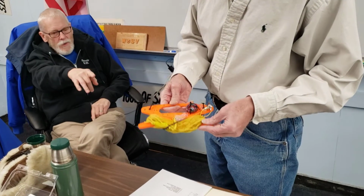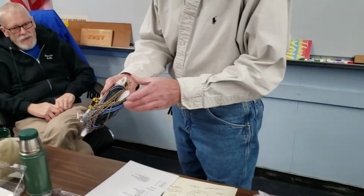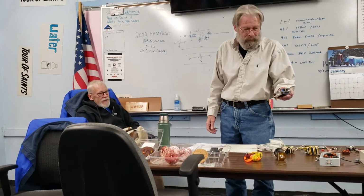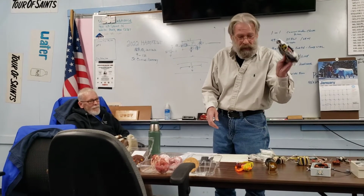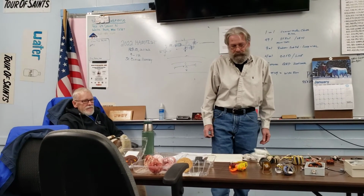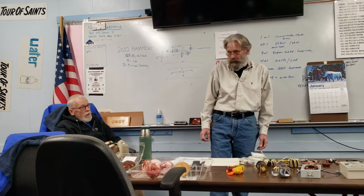Yeah. The other one, the white one, is made out of a breadboard, a little 97-cent Walmart board. Okay. The toroid is about $6. Yep. A few dollars with a wire. Yep. There's really nothing to it, and that'll work all bands. And how easy it is to wrap everything up, throw this in your backpack. Excellent, excellent. But it's low power, 15-20 watts for the smaller ones, 50 watts for the bigger one. So yeah, all low power stuff.